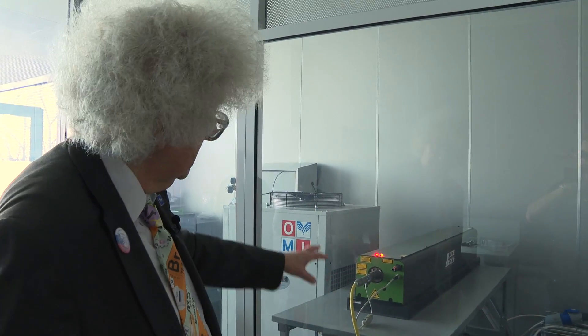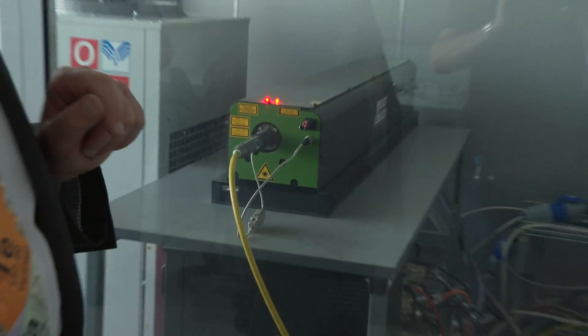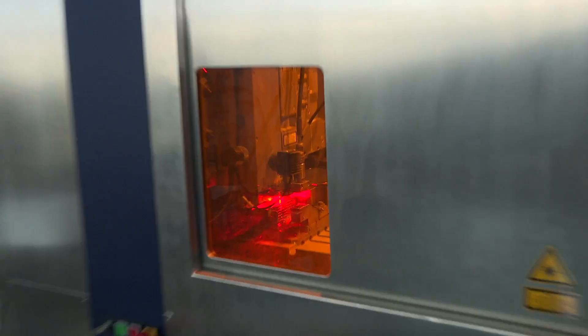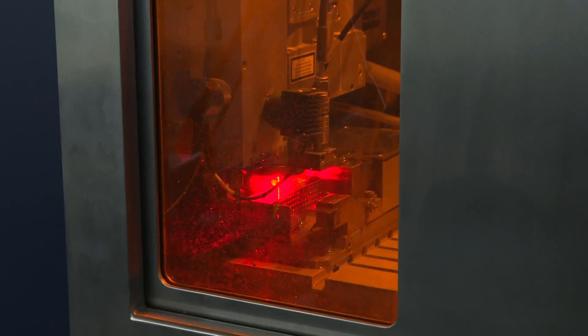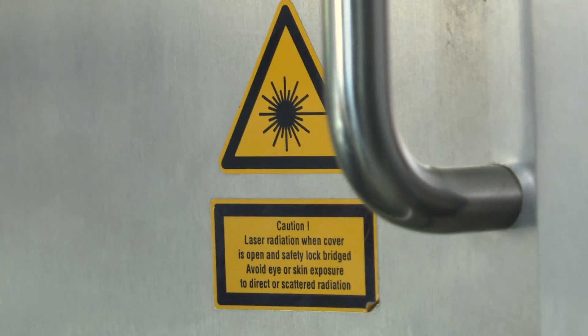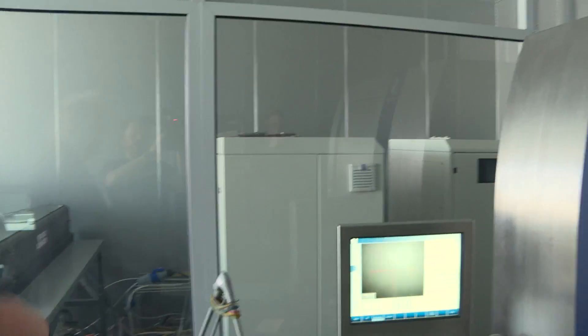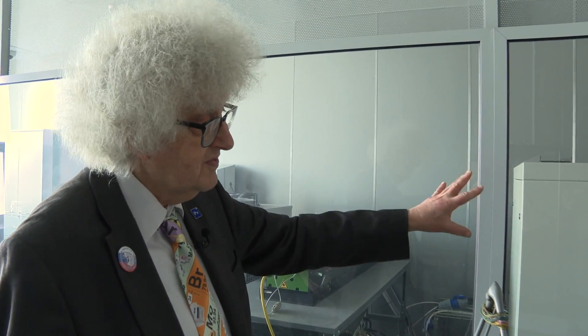You need a very high power laser — far too big to fit in the box. So the laser is outside in this long rectangular box, and the light beam goes down an optical fibre into the box where you do the cutting. What is really important is the purity of the water. These big boxes here are for continuous purification and cooling of the water, because the laser generates a lot of heat. So you have water purification, the laser, and the actual cutting box.